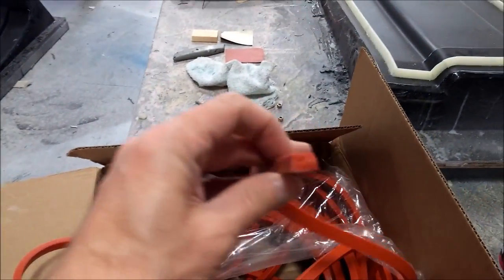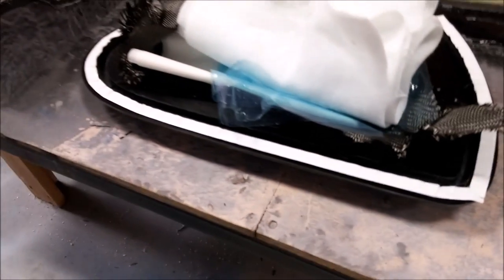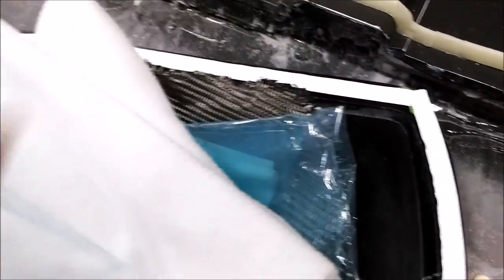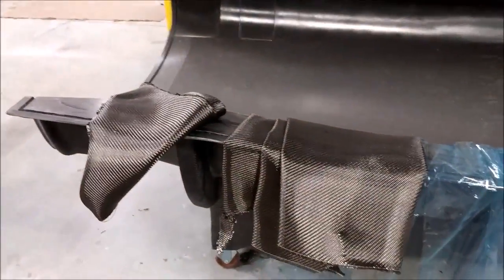Once that's ready, we'll have a mold pulled off of it. We mentioned buying some silicone rubber profile instead of the wax profile — it arrived, about 100 feet of it, and we'll be trying that out on the next mold. This is the double-sticky tape we use around the molds for vacuum bagging. The brace is all set with all materials laid out, including the core. There's also a bunch more material ready for the roof braces that Jeff cut out, as well as all the remaining pieces for the forward bulkhead, already cut and ready to go.